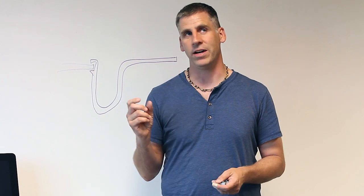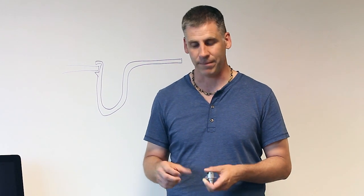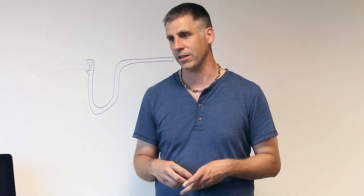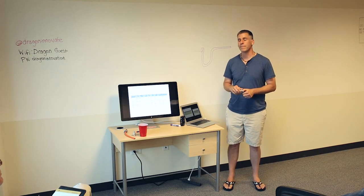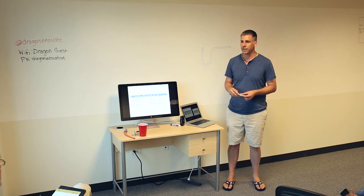So if you had a really thick, like suppose you go big and you go for that 10 millimeter wall, you know, that's probably going to be a lot more brittle because you're going to have a bigger grain. Whereas if you keep to a 2 millimeter wall, it's going to be a tighter grain and a little bit more forgiving. I'm thinking things like heatsink fins, which are, you know, 2-3 millimeters. Yeah, they would typically be more brittle than if they were extruded.